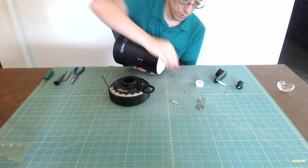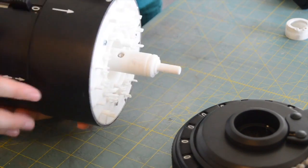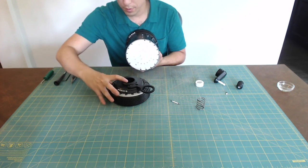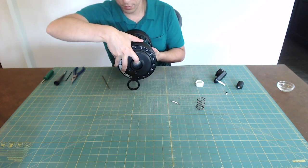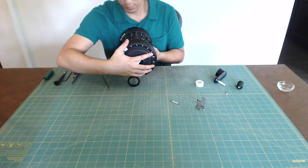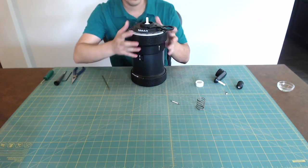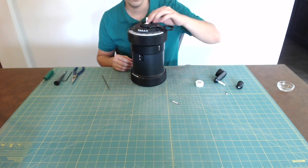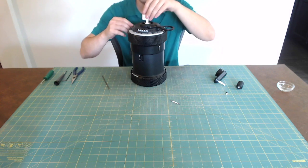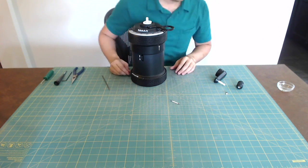Hold the Curta body horizontally and drop a 6 mm ball into the hole in the side of the main casting. Keeping the body horizontal, slide the completed carriage onto the Curta body, aligning the first results dial with the first selector knob. Place the carriage pressure spring and retaining ring into the crank collar and secure them with a C-clip.